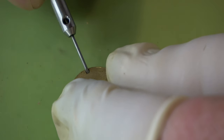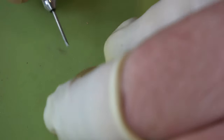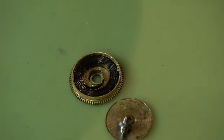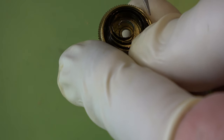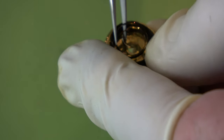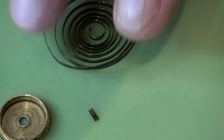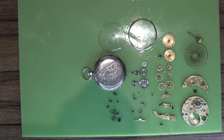Now time to open up the mainspring barrel and see the state of the mainspring. I think it's definitely the original spring. More modern springs have an S shape to them. And that's the issue - your mainspring is not flat. Can you see that little bit at the bottom? That bit there should be attached, and that catches into the barrel - and that's what stops it spinning.